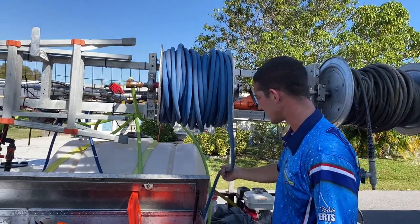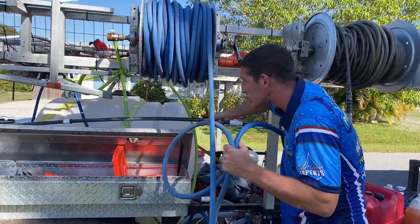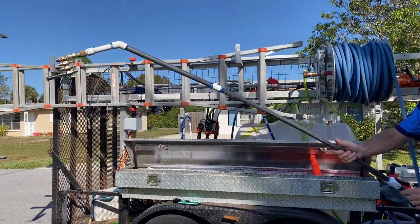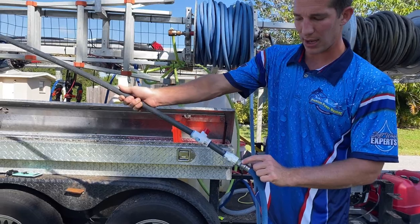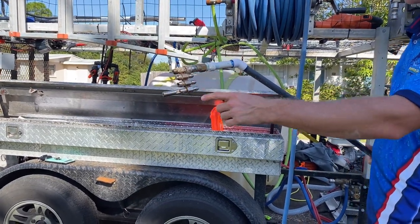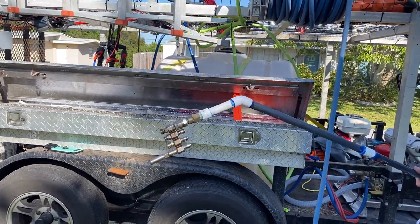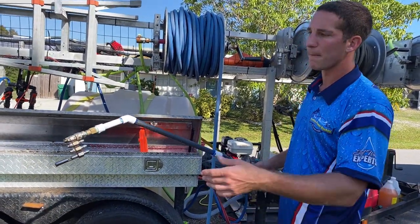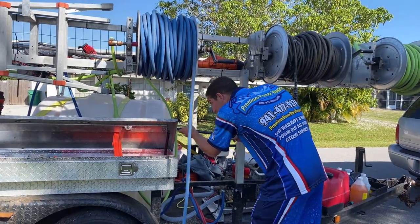I have three reels — all Titan reels. My first reel has 250 feet of half-inch hose for my soft wash. For shooting big roofs I have my J-rod with a homemade setup: a ball valve to shut on and off, connecting with a stainless steel half-inch nipple. The J-rod itself is about $50–$60 on Amazon — make sure you buy the proper one for your pump's gallons per minute. The whole remaining fittings can be made at Home Depot for $20–$30.